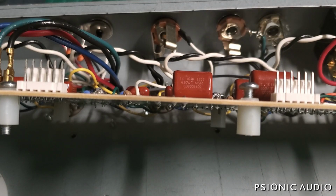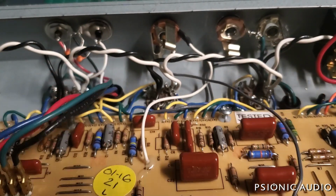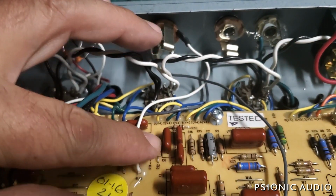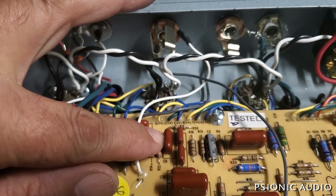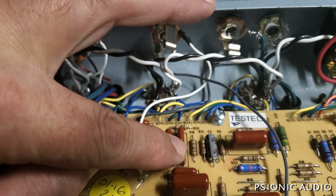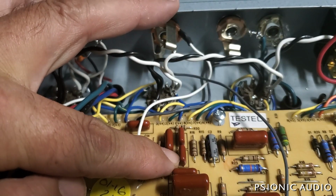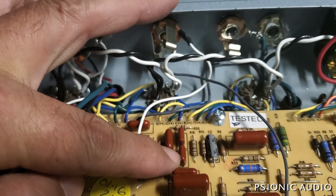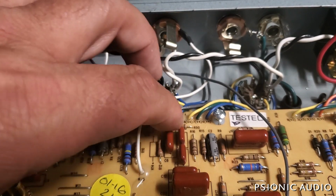And the other part of what we're going to do in this area, I'm not going to show everything I do on these, but I'll show this as a little thank you to everyone who watches these. The three capacitors in the tremolo circuit are a 22 nanofarad, a 10 nanofarad, and a 10 nanofarad. Actually, it's in this sequence, this one, then this one, then this one. And if we remove this 10 nanofarad and put another 22 nanofarad there, it will give us a slower minimum speed without dramatically slowing the maximum speed. Most people don't use the max speed, but we will do that.